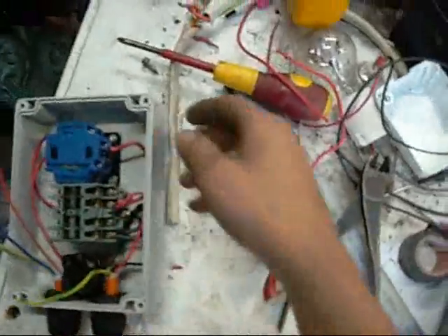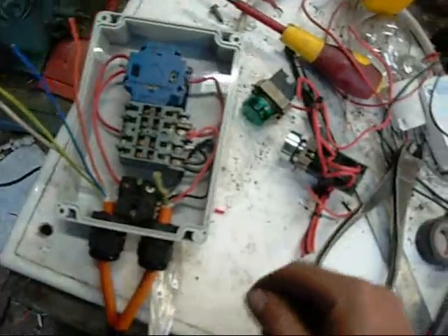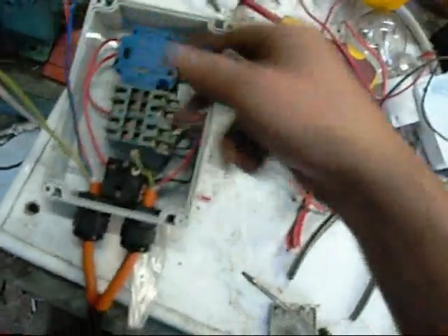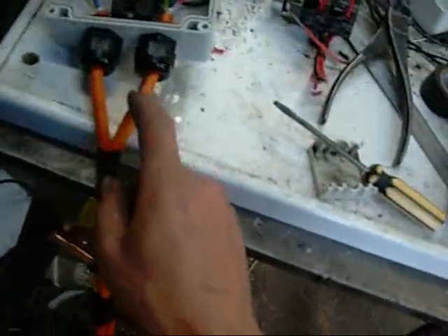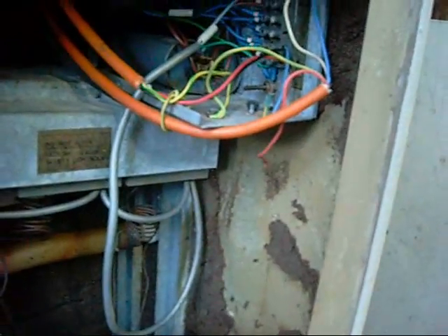I've got the contactor working. I'm in the second position and I'm currently working out the pump. It's going to have a lead going from active bridging to the blue. I had to run two cables because I don't have multi-core control cable. A good 8-core industrial control cable would have done it, but since I've got 3-phase and single phase I might as well use the single phase lead as the active and neutral — I need a neutral for the lamp and the contactor.